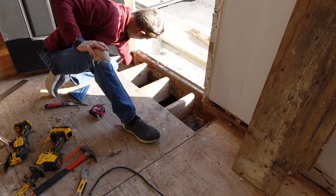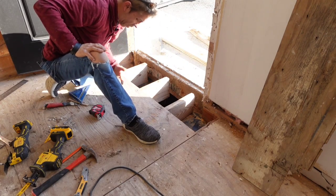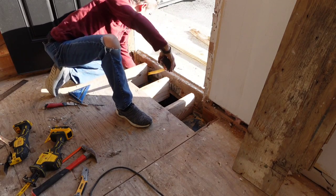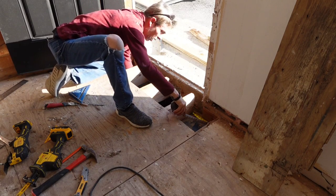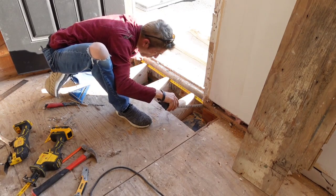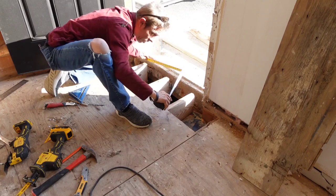It's a little bit taller at the top, which is fine because that gives me more meat underneath that wall. The bottom we were at 38 and 15/16, and that top here at 39 and a quarter, tight. 38 15/16, 39.